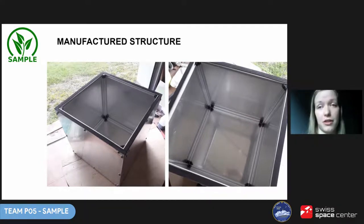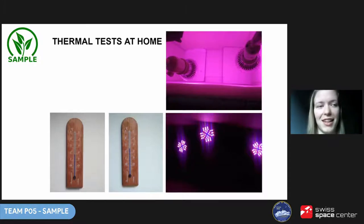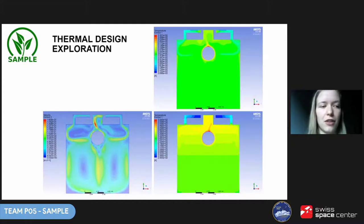This is a photo of the finished structure. Other team members worked on other tasks. Because the module was in a different city than the lamps, thermal tests were conducted in a cardboard box — we wanted to verify our calculations. In a closed cardboard box, after the temperature stabilized, the interior was over 7°C warmer than the exterior. This confirmed our calculations and even exceeded them slightly, as we had predicted about 5°C. Since the designed cooling system couldn't be implemented due to COVID-19, further research for an improved cooling system was pursued — the main idea being to move hot air through a channel where it would be cooled down using simple cooling fans. A simulation showed this could maintain a steady temperature inside of around 300 Kelvin.